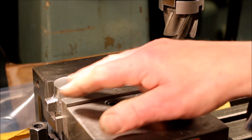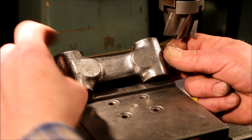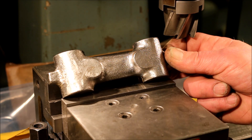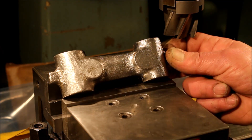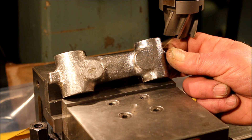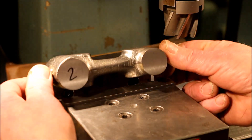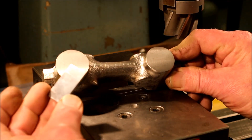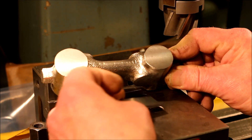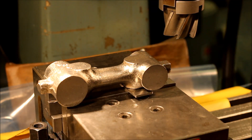All the parts are now milled on the other side as well. But I didn't mill it all the way down to one and a half inch height yet. I like to find the center in this area so I have the same distance from the center to the bottom and to the top. I think it's better to mill this surface first. As the smaller arms are a little bit slimmer on this side, I milled and ground a little piece just to keep the distance, so all the parts will be in the same dimension. It makes it easier for the rest of the work.